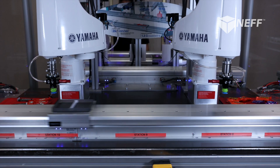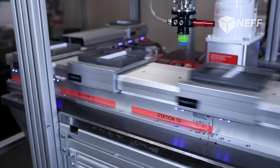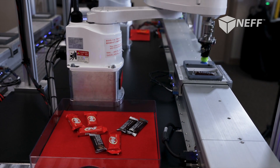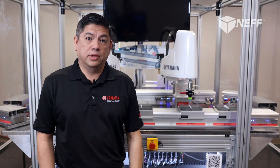The Yamaha LCMR200 is a servo conveying system designed using linear motor technology utilizing individual servo-powered pallets or carriages called X-Bots. Up to 50 pallets can be programmed to stop at any virtual workstation you design within a conveying process. You can control each one bi-directionally or varying the speed independently all within your PLC logic. For example, if you want to set up three stations along a one meter section today and then tomorrow you need to add a fourth station, no problem — just program a new virtual station and you're all set.